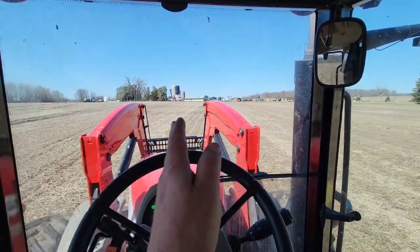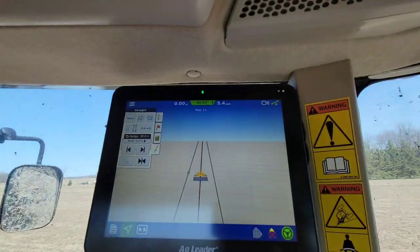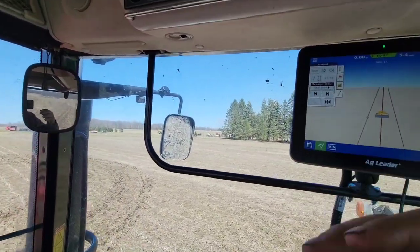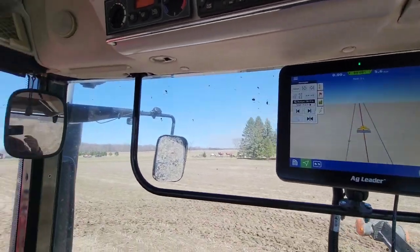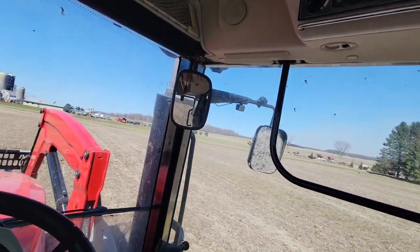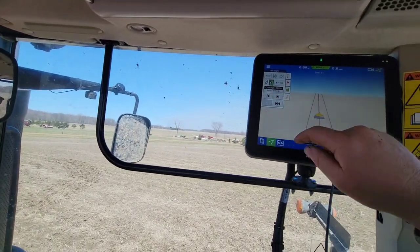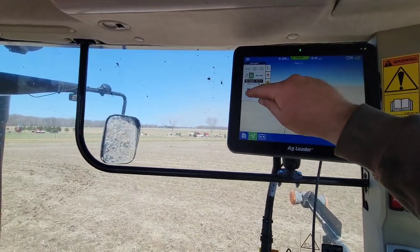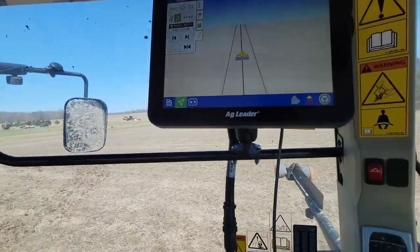See, that might take some of that aggressive to hold on the line. What you might notice is if you're too aggressive it'll go left to right to left. So you bring that aggressive down, but if you go too soft it might get off to the left. See, now we're up to three-inch errors where we didn't have that. So if we take that back to 15 — it was at 10 — let's go the other direction and see how that did.